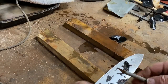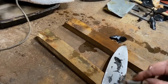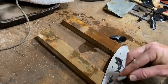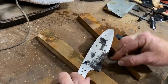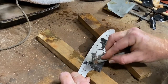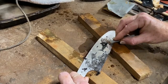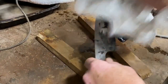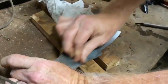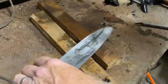When I've got all the areas etched, I can peel off that self-adhesive vinyl. Sometimes it's easier to do with a little razor knife, just to scrape away the vinyl. Then you can use some emery or sandpaper to clean up the blade. Electro-etching the way I do it, I really end up with a very deep etch — you can catch your fingernail on it. You definitely want it to be able to hold up to cleaning it up with that emery paper.